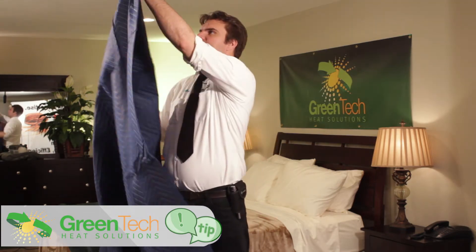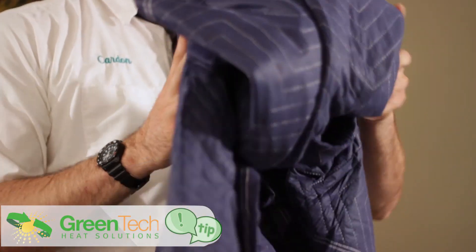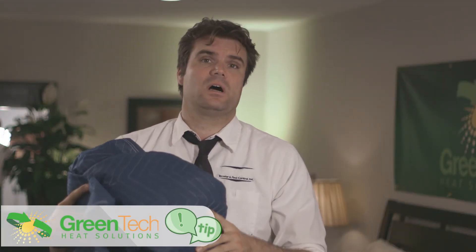These things are also very helpful if you buy the biggest one possible, because with the Titan system you want to make sure that air isn't just barreling out of the door — just enough pressure needs to come through. It's a good idea to put this on top of the door and staple around it with the stapler I recommended in a previous video to keep that air inside. This works a little better than three-mil sheets of plastic or anything else that restricts airflow, because it's heavy. In one sentence: having an extra seven or eight of these, especially at their price, is totally worth it.